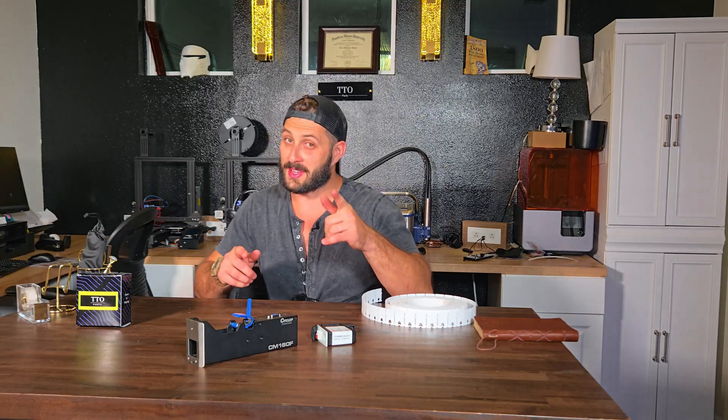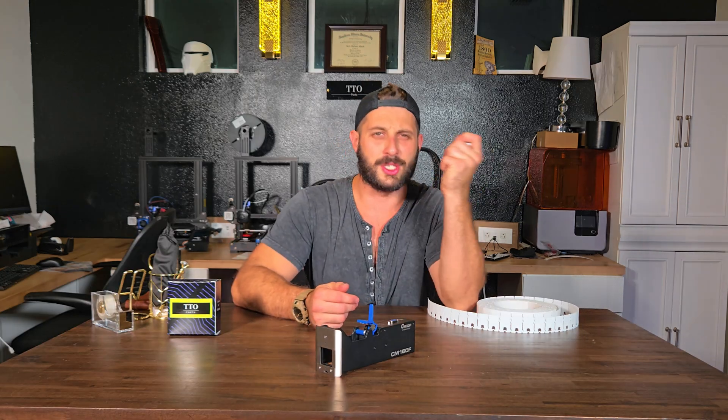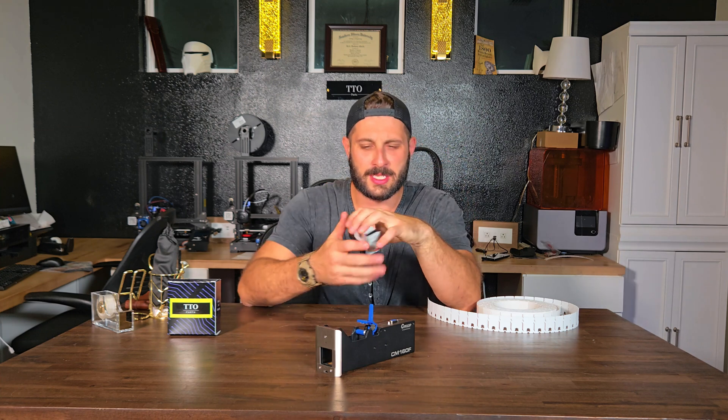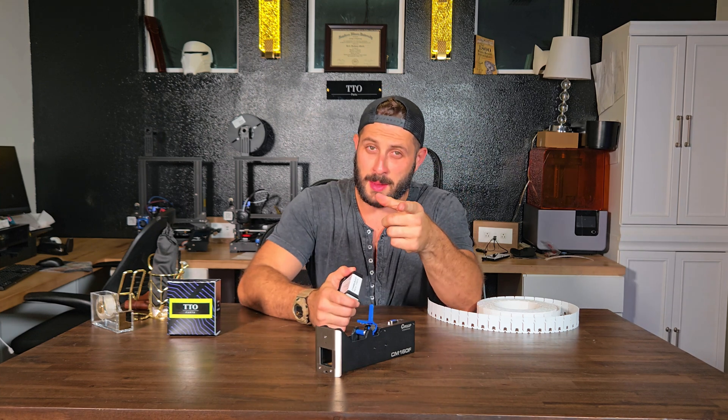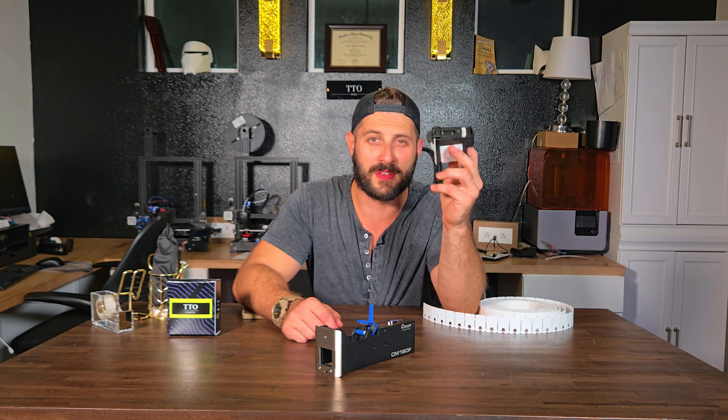Price being an issue prompted several weeks of testing. I tested four different TIJ printers, five or six different inks — all solvent-based inks — and came up short on every one of them. And then I got the CM-160 in-house with this little cartridge that saved the whole operation and saved the customer a lot of money. Remember how the bread tabs were all CIJ with an MEK-based ink? Well, so was this — this is an MEK thermal inkjet ink. And it passed with flying colors.